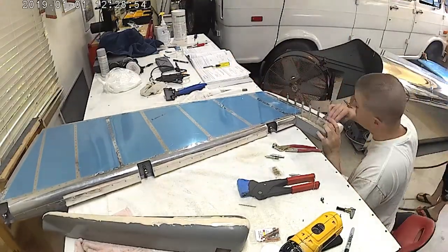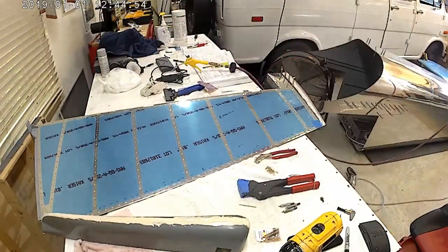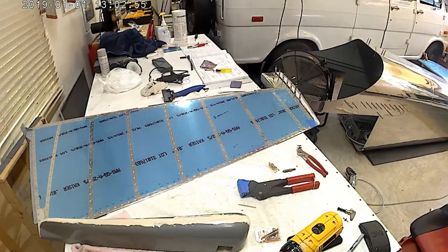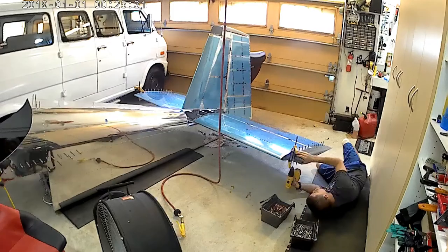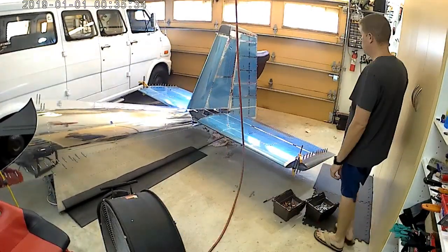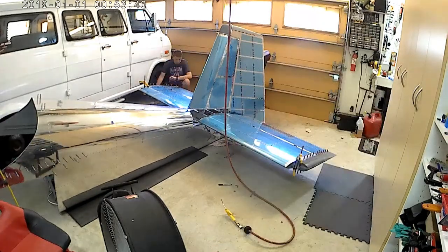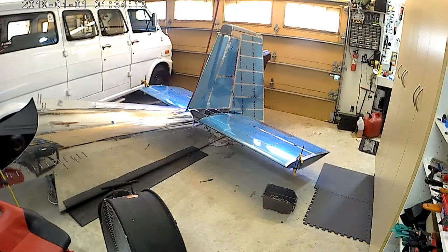I was using a Pop Rivet Close Quarters Dimple Die from Cleveland. It's the only product from Cleveland Tools where I've said it wasn't manufactured as well as it could have been. They come with copper posts to use the squeezer on, and those copper posts almost always shear off before it even imparts the dimple. I went back and bought a Pneumatic Pop Riveter from Aircraft Tools Supply, and they sent close quarter Pop Rivet dies as part of a package. The close quarter dimple set from Aircraft Tools Supply comes with a very heavy duty steel post, and I've yet to have that snap — I can put a good amount of force on my pop riveter and actually impart a dimple.